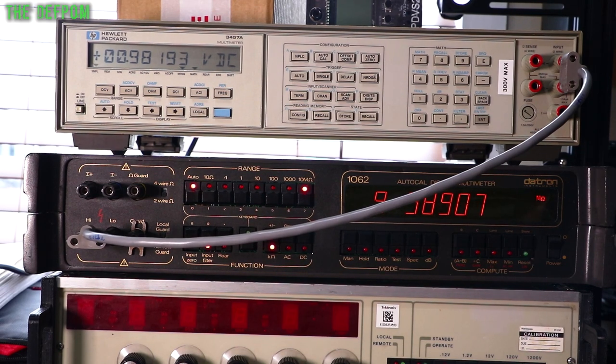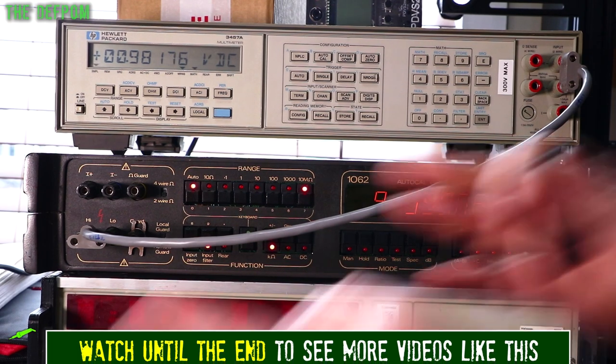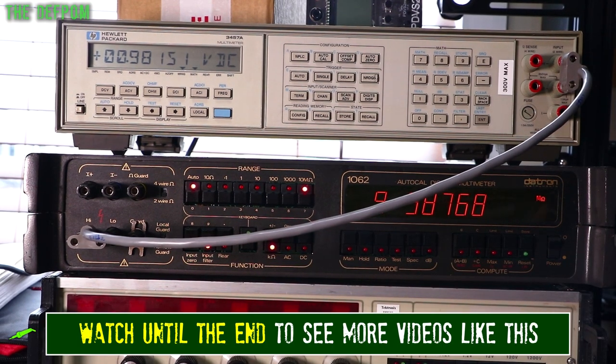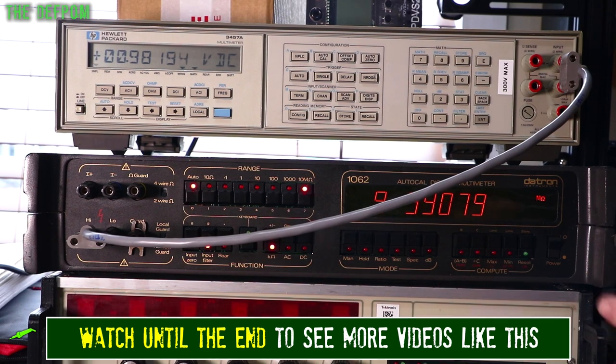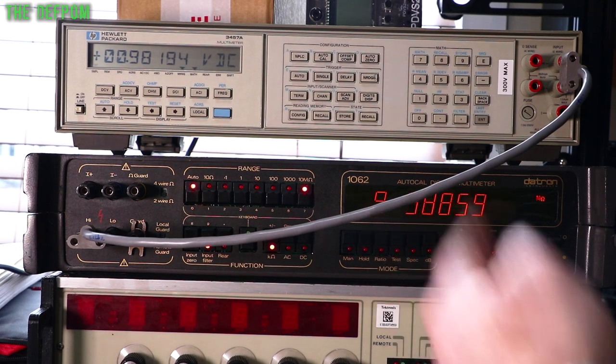And gigohms is having a negligible effect on my boards. You're talking about a really small percentage. So I was tuning for that, and it'd be fine. It'd be linear. It'd look absolutely fine. Bring it over here, different story. Slightly different input resistances. It would change it. When I went to higher voltages, it skewed the output. So the output actually changed.